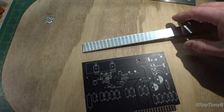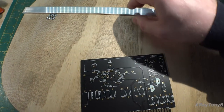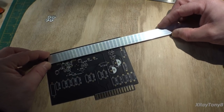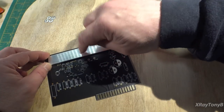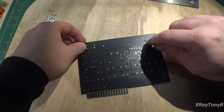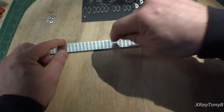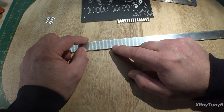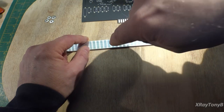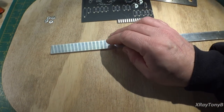Very simple tools — you can just use a hacksaw or whatever you have to cut that off at length. Once I cut it to length, I took some masking tape and taped it very accurately to the board, then flipped the board over and marked and punched the three holes. Once I did that, I drilled them out. If you have access to a drill press it's much better, because it drills straight through; with a hand drill your hand can move and drill at an angle, but it's doable if you're careful.